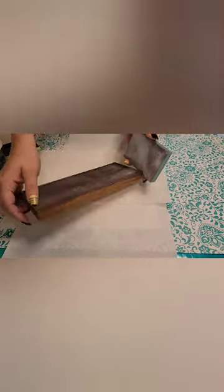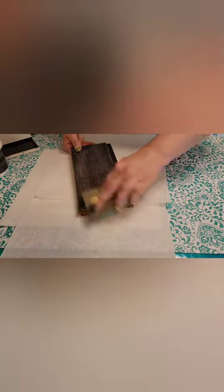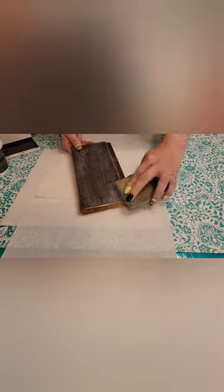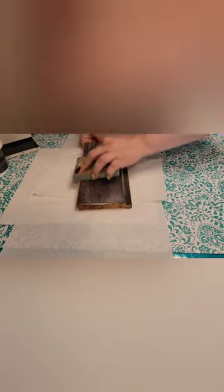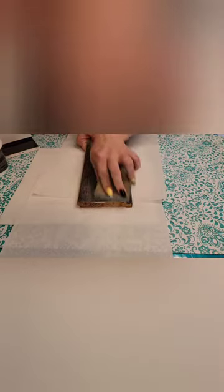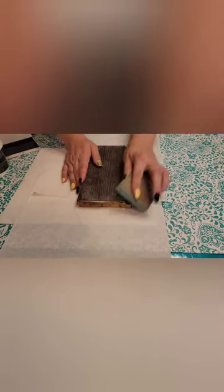I did make a mistake in this case and used 220 grit sandpaper, which is actually much too strong. I should have used a higher grit because what I ended up doing is sanding through my sealer and my stain. I would recommend probably about 300 to 320, anything up to 400, but not much higher or it's going to be a little difficult to sand or it might gum up your sandpaper.